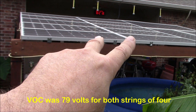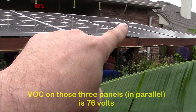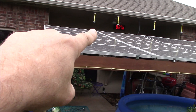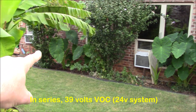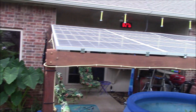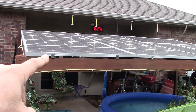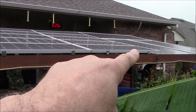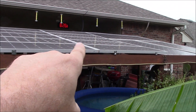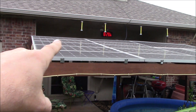So I've got two strings of four panels for 800 watts, paralleled in with 1,300, giving 2,100 watts. These two panels left over are going into the bedroom system, since I'm not running the window units anymore and don't need all that power. With these panels you can get pretty creative with wiring — now I have a 2,100 watt array going into that one controller to boost power in winter and charge the lithium batteries.